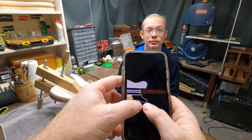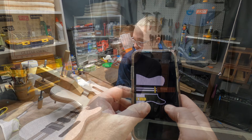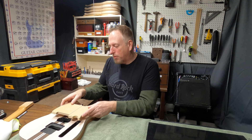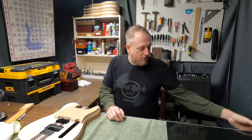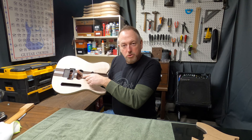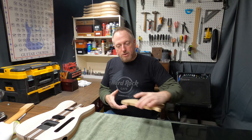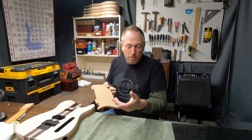It still works as a pickguard. We could make that of plastic or we could do it of wood. I'm going to use this pickguard template, trace around the edge, make my line, and cut out a few of these pickguards for Corwin and probably one for myself. We've got a couple pieces of material: the three-ply plastic which you just order online, and we have wenge — one inch thick — and I'll cut it vertically through a bandsaw into thinner pieces, so we'll get probably three or four pickguards out of that one piece of wenge.